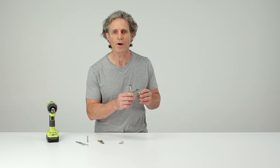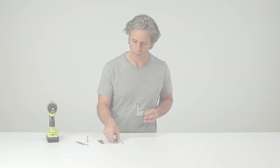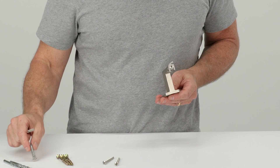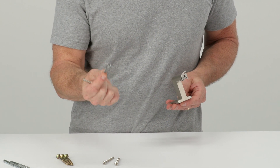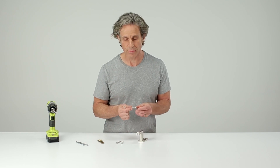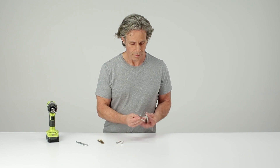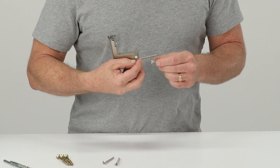Now, you can't use a regular screw, but one option for attaching the bracket to a masonry wall using our beautiful stainless steel screws is to use a commercial wall anchor. These are available at most hardware stores. They're also called lead anchors, although they're made out of zinc, and if you insert one into the brick wall you can use a Promenade screw to go through the bracket and into the wall anchor.